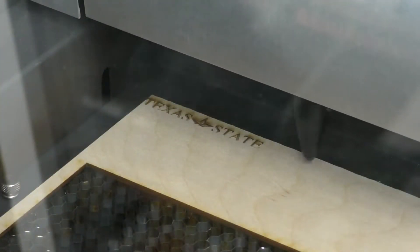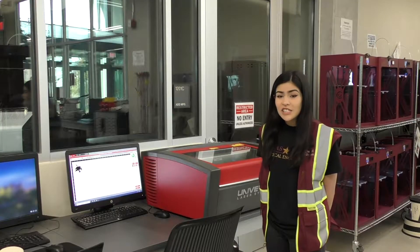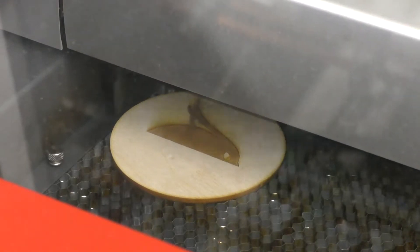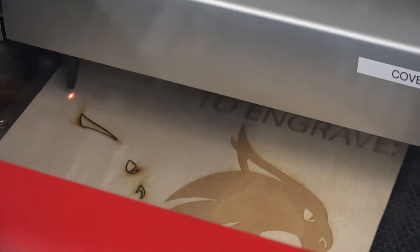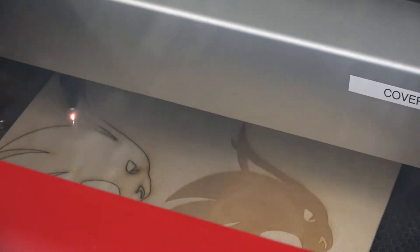This video's focus will be on the VLS 350 as it is our entry-level laser. Laser machines such as ours have two main functions: cutting and etching. Etching is a process in which the first layers of the material get engraved without piercing through the material line-by-line sequentially, while cutting is when the laser is turned up and cuts along an outline or path all the way through the part.